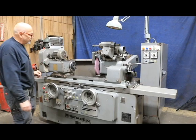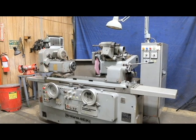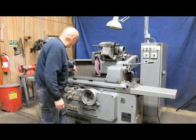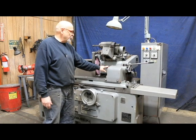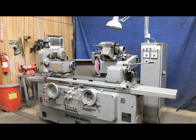The width would probably be 2 inches, depending on how you had the wheel recessed. The headstock, if I'm not mistaken, would be a Morse taper number 4, along with the tailstock — also a Morse taper number 4 — but you have to check the quotation to be sure of that.